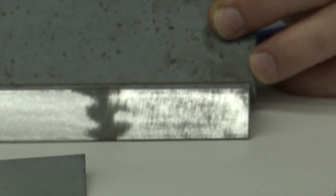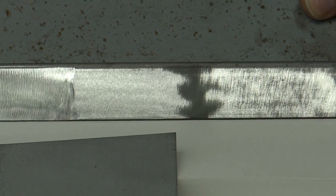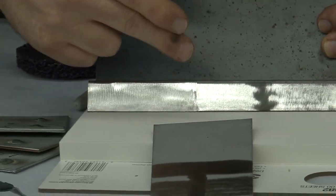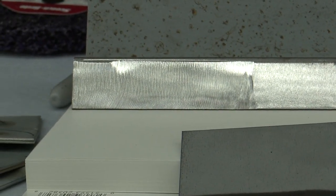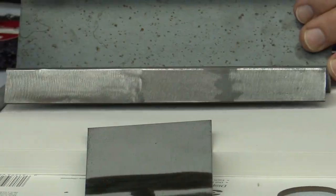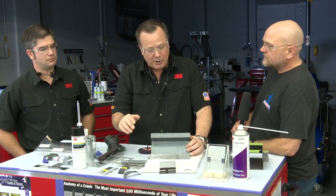And this next one here is a Scotch-Brite belt, okay, the coarse Scotch-Brite belt, which is really great. We've got this listed as one of the tools to use when cleaning flanges off. And the last one here is a roll-lock disc, okay? The nice thing about a roll-lock disc is that because it's so flat, it tends to plane the surface really flat, as opposed to, let's say, a grade 80 Scotch-Brite belt, which puts ups and downs in the surface, whereas the roll-lock planes it really flat.